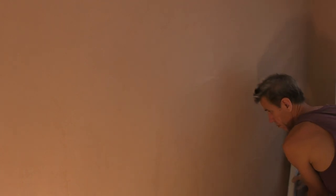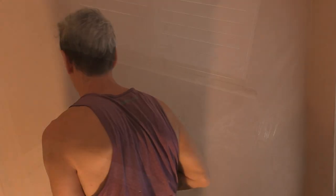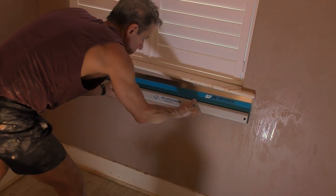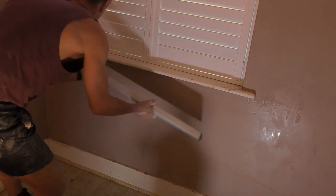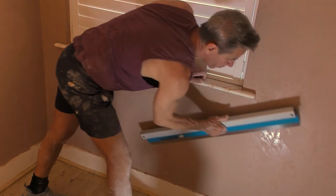I'm literally using this as if it was just a big trowel. If you're going to do a large patch like that, even if you're just putting bonding back in to fill the patch, I think while you're there anyway - you've got to wait for the set to go off - you might as well skim the whole wall right across. Patches look terrible. Doing this and covering the whole wall obviously looks a million times better, it doesn't take any longer, and the customer feels like they've definitely got their money's worth.